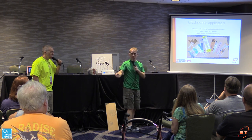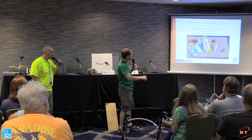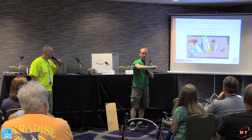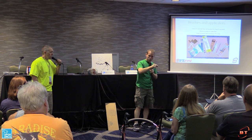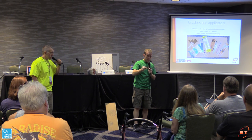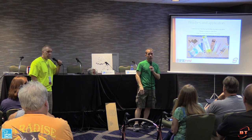And for the clear, for the poly, foam brushes. So if we got a big space, I'll use one of those wide brushes. Practice on something, because what will drive you crazy is you'll see these little tracks, these little lines, and you want nice and thin, but you want consistent. And as it dries, it will self-level, okay?